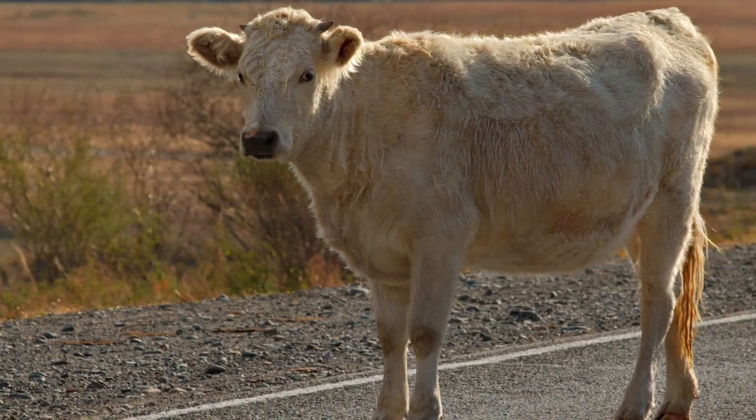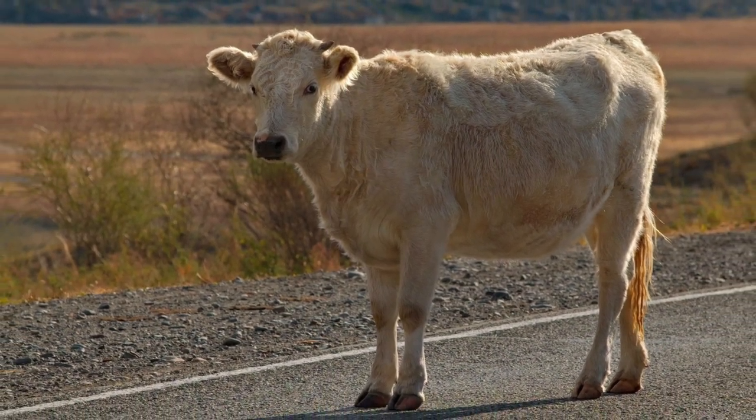We're going to talk about fencing and more specifically electric fencing. A lot of people have that, but we can always make improvements and get tips. The most common area where people have issues with electric fencing is when their animals get out. When animals are getting out, it's typically because we're not getting a good charge on our electric fence, and it's not shocking the animal the way it's supposed to, to create the psychological barrier we're aiming for. When we find these errors, the most common one is in our grounding system.